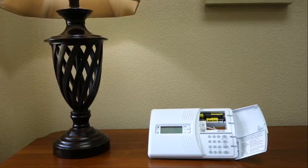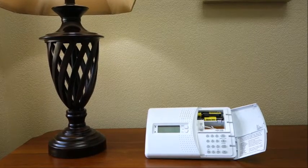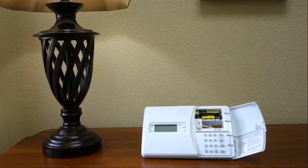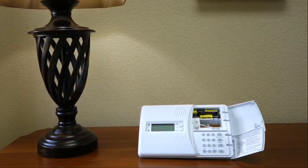The most common US GSM carriers are AT&T and T-Mobile. In Canada, the larger carriers that are compatible are Rogers and Fido. When purchasing a SIM card, just tell the wireless carrier that you need a cellular-only plan. No data is needed, reducing the cost of the plan significantly.